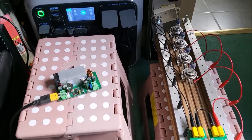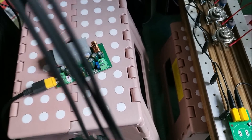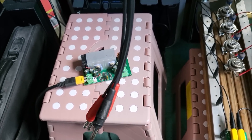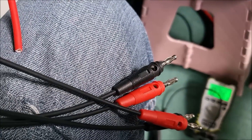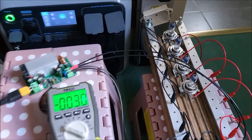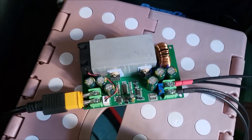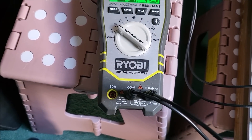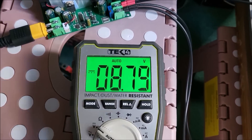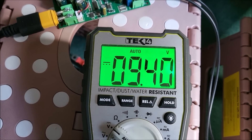I don't have suitable high-current wires between the buck regulator and the light bulb board, so I've made up four wires with banana plugs on the end. The main problem is that 12 AWG wire won't fit into the top of banana plugs, so thinner wire it has to be. All the bulbs are disconnected. I needed to set the voltage — it was reading minus 8.78 volts because I had my two cables the wrong way around.